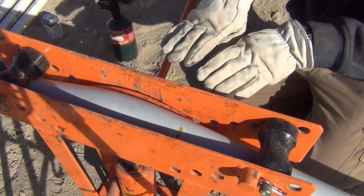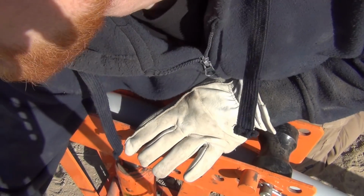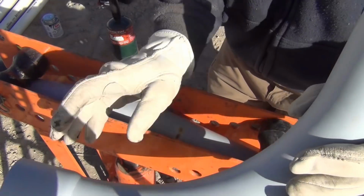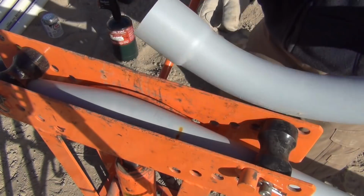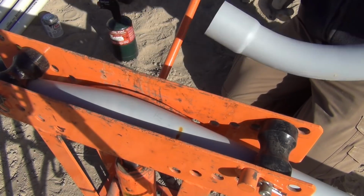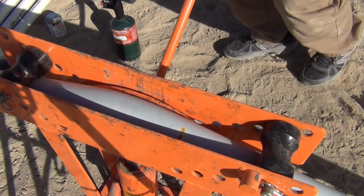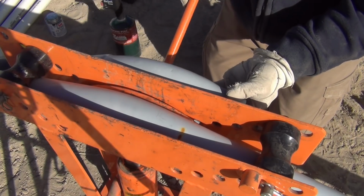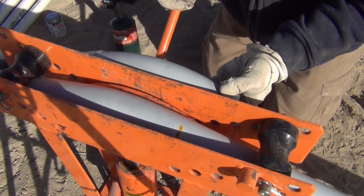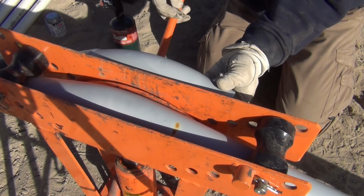If you have something like a bent hanger or a bent wire, or you have a 45, see this one's a 90. The problem is if you use 90s, these joints you can snag. It makes it harder to push wire. That's why it's better to just do it this way. So let me grab a 45. Here's my 45. I'm just going to have this for comparison. You want to have some type of limit to tell you to stop when you're done. So that's about 45.